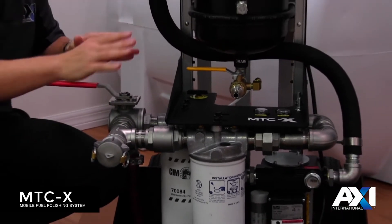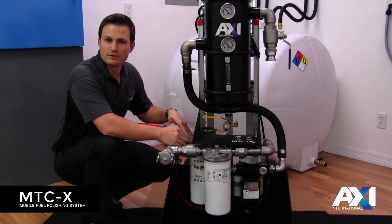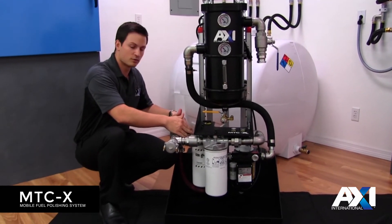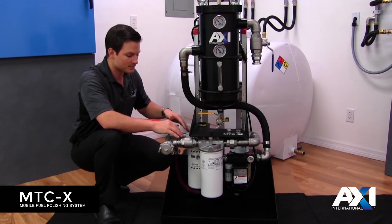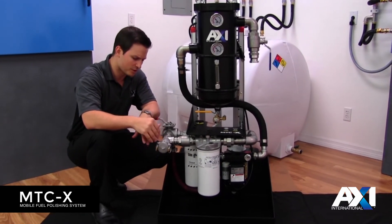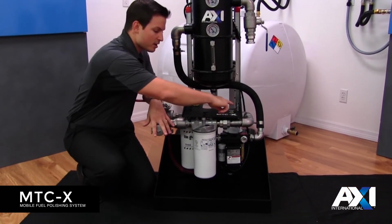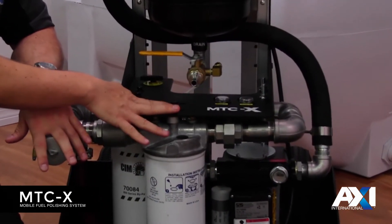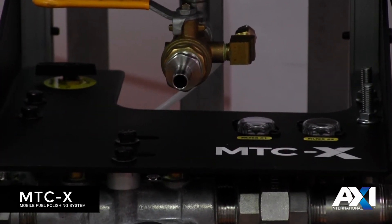Leave the same hose in the tank; the suction hose stays in place too. Fuel will now pass through filter number one first and then through the second filter — these are in series. A 10 or 25 micron filter handles high particulate removal, and if a finer result is needed, move to either a water block or a 3 micron absolute or 1 micron filter. Continue phase three keeping an eye on the two differential pressure gauges — one for each spin-on filter — and also monitor the pre-filter for any remaining large particulate.